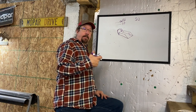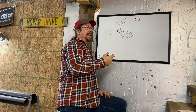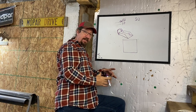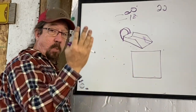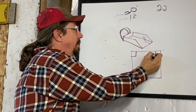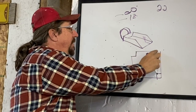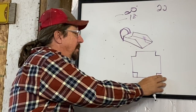As an entry-level project, I would suggest making a little box. I made one when I was in metal shop. I took a piece of square sheet metal, maybe six inches square, cut the corners out. I wanted sides about one inch tall, so I cut out one-inch squares on each corner. So the metal looked like a cross shape with those corners gone. Just use tin snips — that gives you a feel for how metal works, how tin snips work, how you cut stuff.